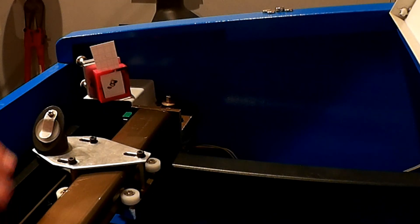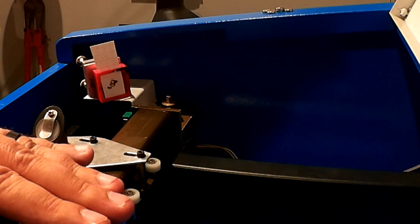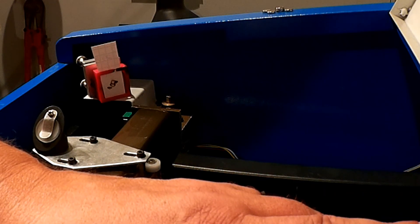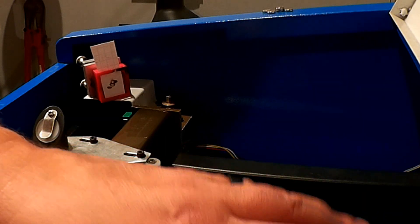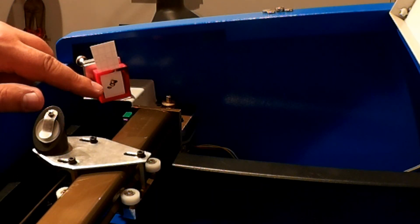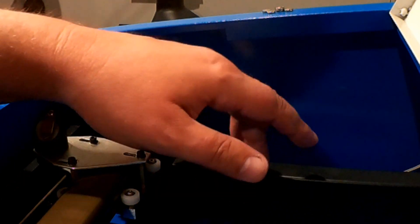And when I pull it forward, the gantry actually tilts up in reference to the sheet metal and the laser tube and first order mirror in the back. So what I'm going to have to do is shim this out a little bit more to change that. Also notice how it walked over from there — that means this isn't true either.